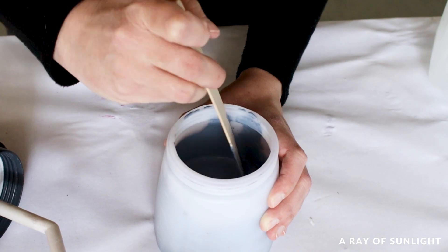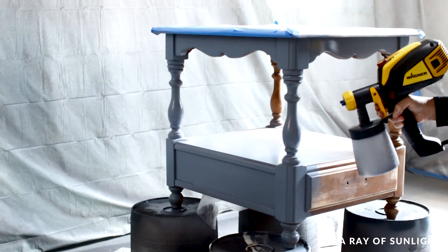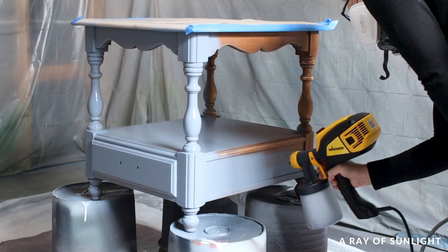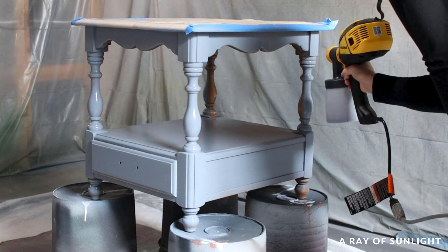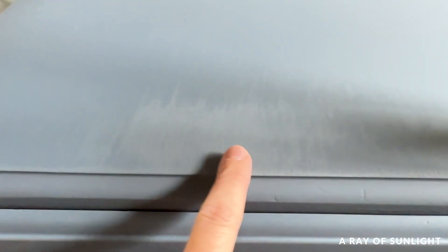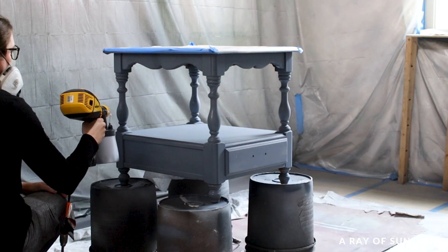See the difference in the thickness here? When I sprayed it, it had a lot of fisheye texture, and if I would have primed before painting I'm sure I would have gotten better results. But even though I used a sprayer here, this paint is one of my favorites to brush on. It's acrylic-based and self-levels, leaving behind a brush-free finish, especially if you add a little water before brushing it on. With the paint dry, can you see these uneven spots? This is where I had sanded to bare wood — if I would have primed, those would not have shown up like that, but for this look it didn't matter as much. I painted on another coat and let it dry for about 24 hours.